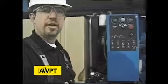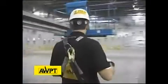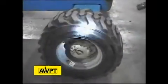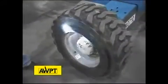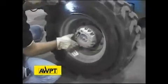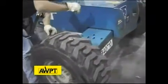We're going to leave the boom elevated so that we can make a visual inspection of the area underneath the boom. Now we're going to perform a visual inspection of the base of the machine. Starting at the tires, we want to look at the tread for lugs missing, gouges in the sidewall showing fatigue, potential tread or webbing in the stitching. We want to look for loose lug nuts, leaky torque hub, loose fasteners. We want to check for leaks inside the drive motor. Things that don't belong wrapped up inside the drive wheel or hub assembly.